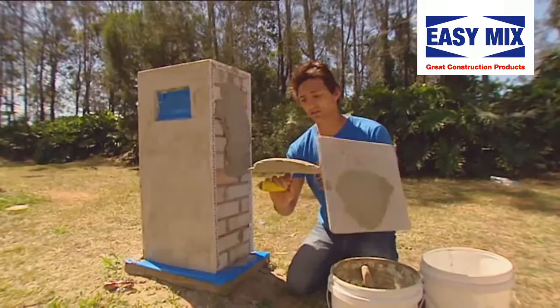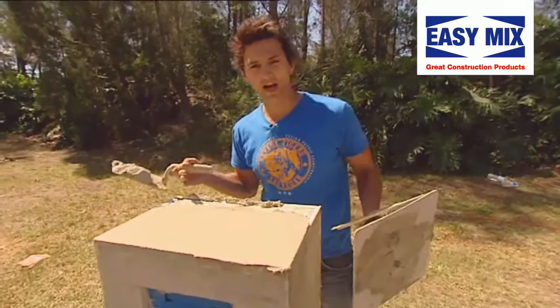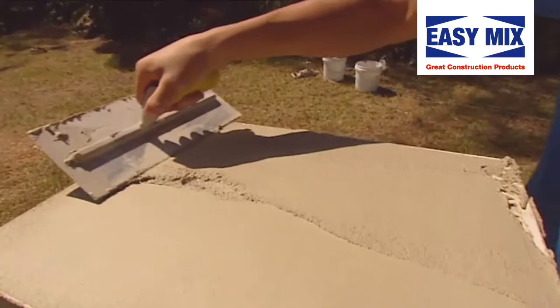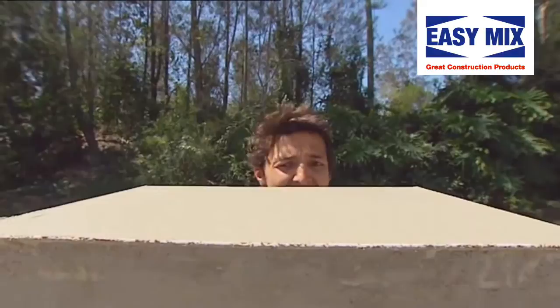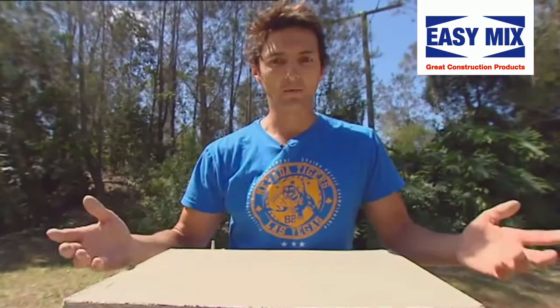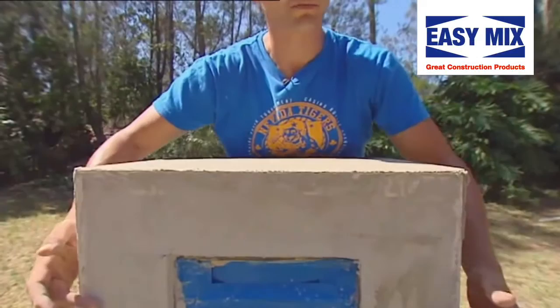By the way, don't be too critical on having 20 mil either side of your trowel — as long as you've got half your trowel full, that's fine. With practice the technique will come. If you're finding the render's a little bit hard to work, just add a little bit of water as you go. You basically want the consistency to be like chocolate mousse. Happy with that — so that's my first coat. You basically want it, when it's dry — if you leave it overnight or at least four hours — to look nice and white. You want it nice and level as far as your eye can tell, and you haven't covered this completely, which means your render's got something to stick to when you apply your second coat.